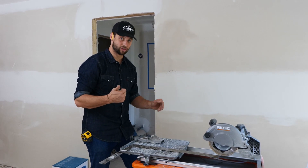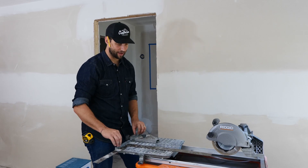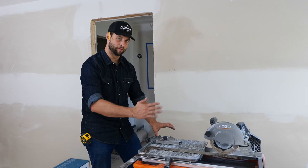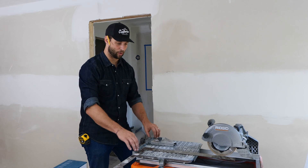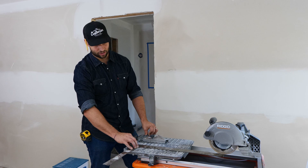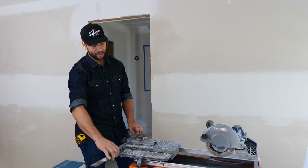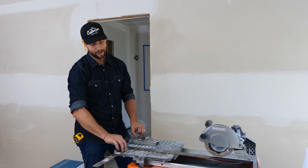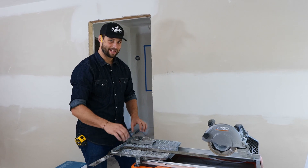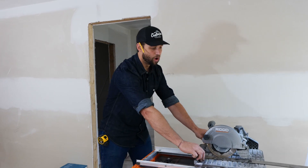There is a workaround I found when cutting larger 24-inch tiles. If I pre-load the table — in this case on my saw — twisting it clockwise, when it comes in those back wheels hit and I don't have any movement in the tile. I found this by pushing several tiles through and finding what worked. I put a big framing square on here and I'm able to run it completely straight. If I go counterclockwise until it stops, as soon as those back wheels hit it pulls back to the clockwise stance. So just keep that in mind — it has play back there, but if you load it to one side and stay cognizant of it, it runs very straight and true all the way through.